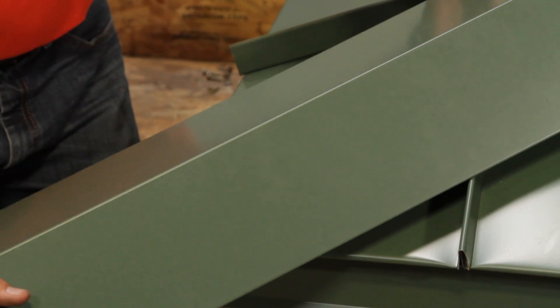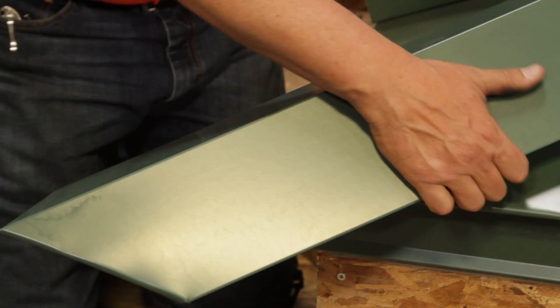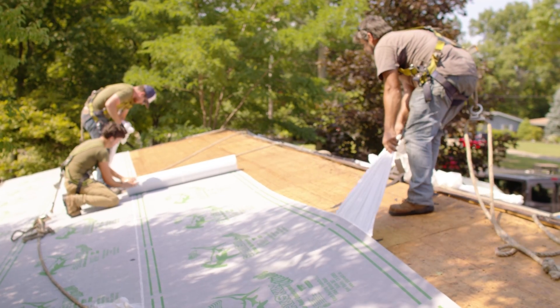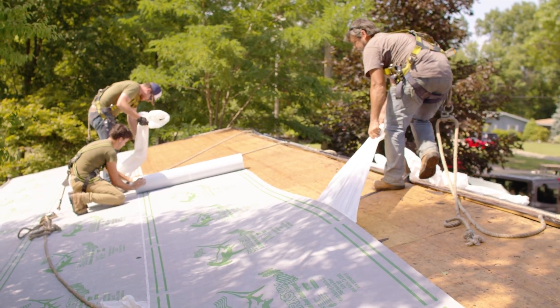You've got to remember, if you have a vented ridge cap or a system like that, it's vented because you basically have plywood or whatever type of decking at the ridge of your roof cut out — so there's a big hole. Any little bit of moisture can become a concern because you don't have the secondary precautions of underlayments and deckings. It's going to be wide open.